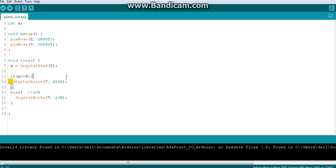When x is zero: digital write 7 high. The else part handles x equals one, because digital input can only be zero or one. If the if condition checks zero, the else will have one. One means the button is not pressed or released, so at that time we want the LED switched off — digital write 7 low. When it comes to pull-down, the condition check should be the other way around.